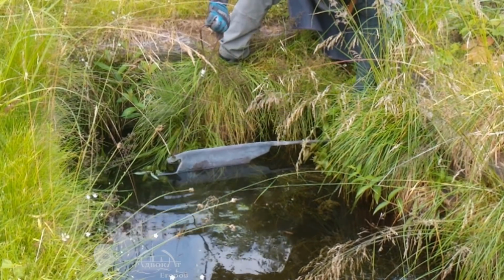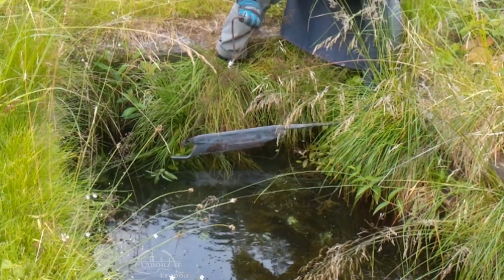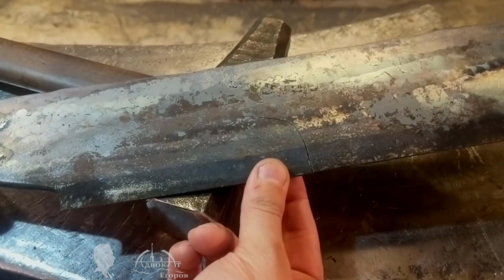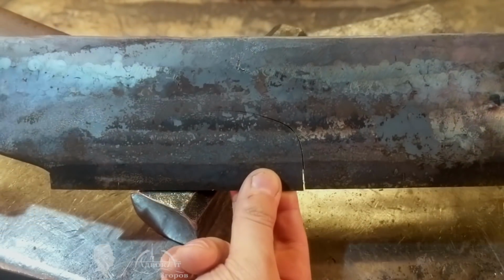It is obvious that if a heated steel plate's side is cooled for a long time, the internal stresses will increase, and the cooled side will gain hardness and brittleness, resulting in its cracking with the very unpleasant sound of a complete fiasco.